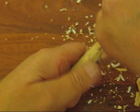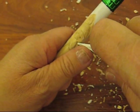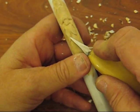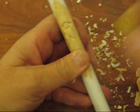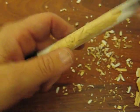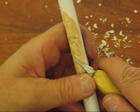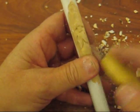Here at the nose, where the nose and the mustache meet, you want to make a little triangular cut right where the nose is to give it some depth. When this comes up together you want to dig that out a little bit on the underside — we'll put the mouth in in a minute. Remember to keep your knife nice and sharp; it's imperative. When you do something this small you're not putting a lot of pressure behind it.